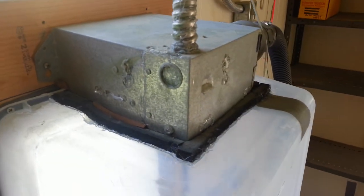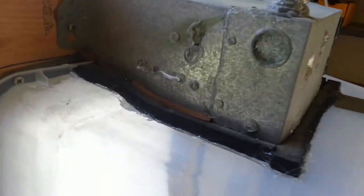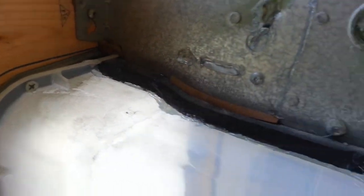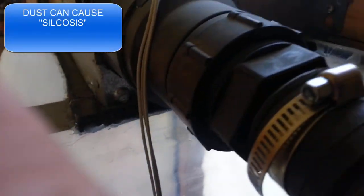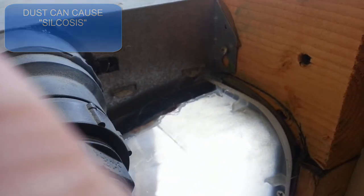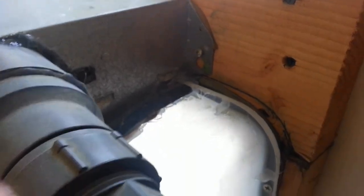One of the things I was having problems with was air being sucked in around the blower head. I really had to hot glue gun this foam down, and I cut the metal wrong here so I had some extra foam right there. You really want to make sure you're not sucking sandblasting fumes — or with paint you get isocyanate.